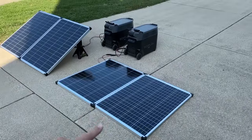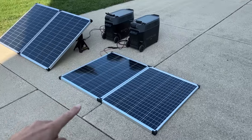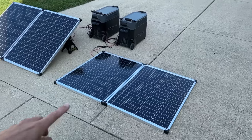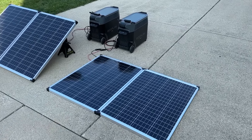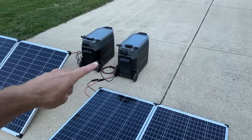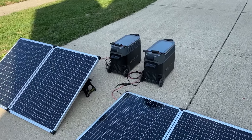We have two different sample points. We have the flat panels, which are two 100-watt Thunderbolt panels from Harbor Freight. These actually go over 100 watts under standard test conditions, so with perfect conditions you'll get over 100 each. We have these wired in series to up the voltage, because if clouds roll through, one panel might dip under the minimum voltage for the EcoFlow Delta Pro — where we're going to store the energy — and we don't want that to affect the test results.